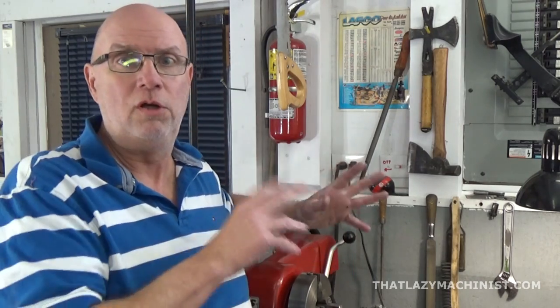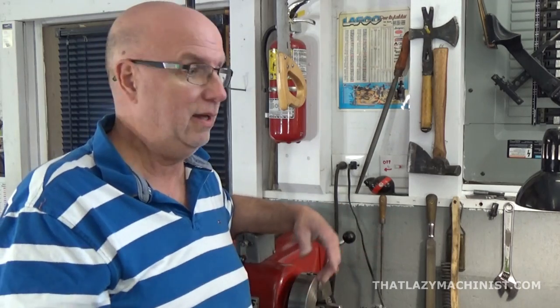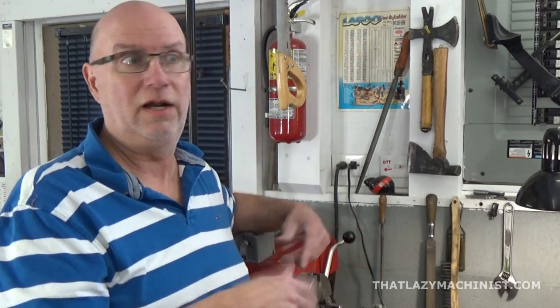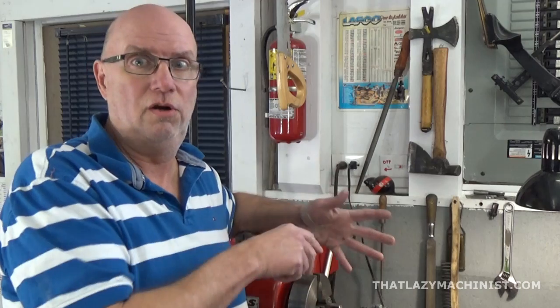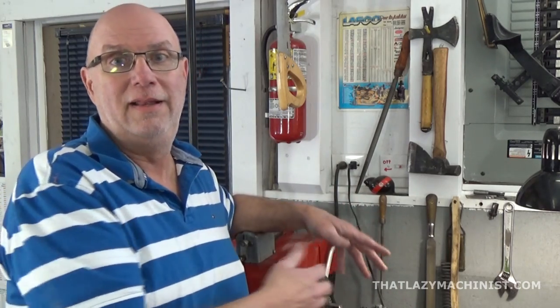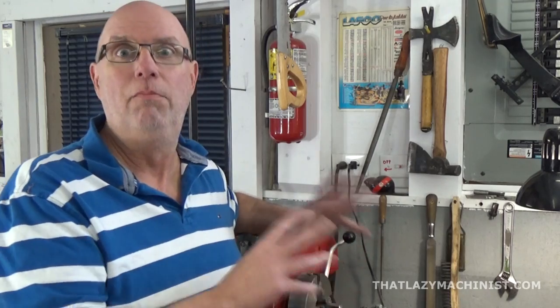Now, then I'm going to do the same thing for an adjacent surface to get that second axis offset. But I don't have to start back at 0. I'm already at 39 thousandths of an inch, and I know I want to get to 68 for the second. So all I have to do then is just turn the part, well, ramp off, turn it, come back on, and then move the part to my 68 thousandths of an inch, and I'll have both my offsets. So let's take a look at that.